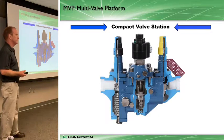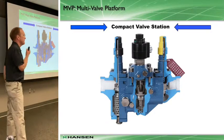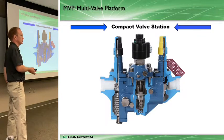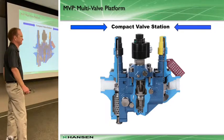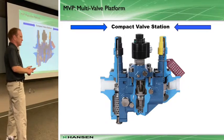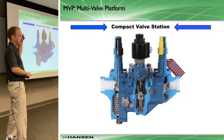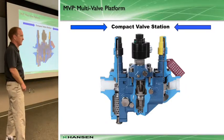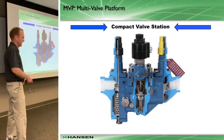That situation highlighted something important. They did an end-user survey of where ammonia leaks occur within systems — probably five to seven years ago. The places where ammonia gets out most commonly was around flange gaskets, especially at evaporator groups, because that's where flange gaskets are concentrated — there are more of them and more vibration.